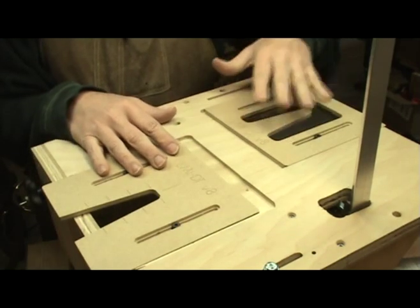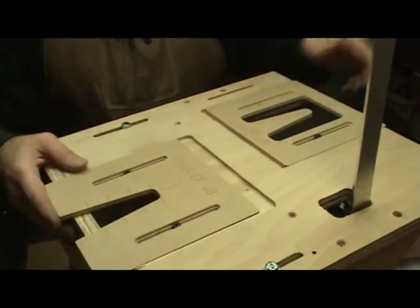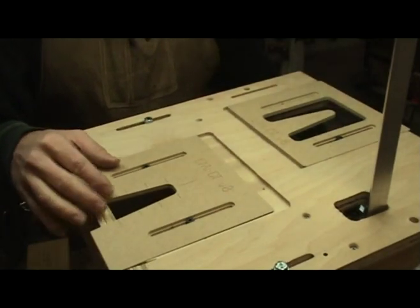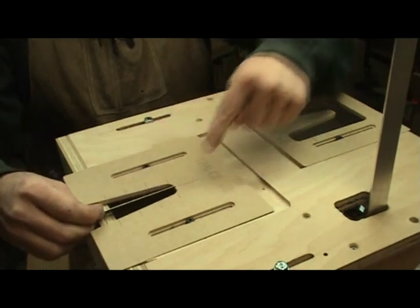So I never try and cut it perfect. Now you can get it really close. What I need to do is set this. This is the mortise side of the dovetail, and I've got this set to approximately a little bit less than the body depth of my guitar.